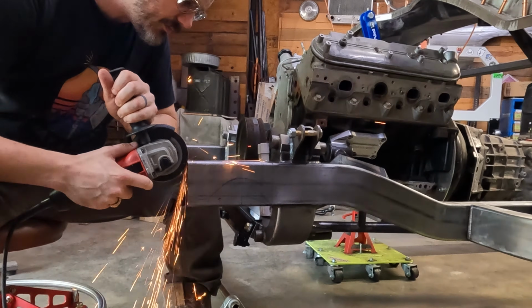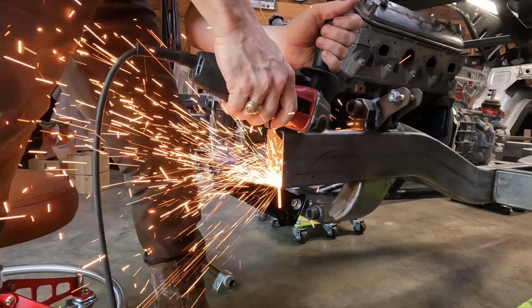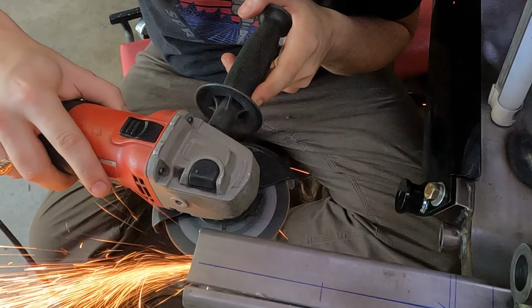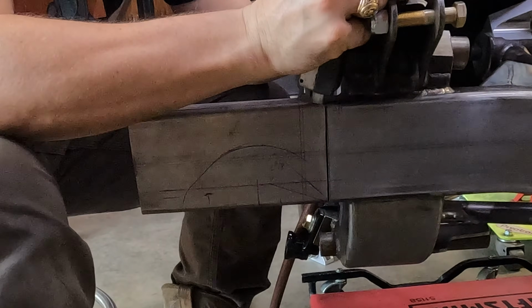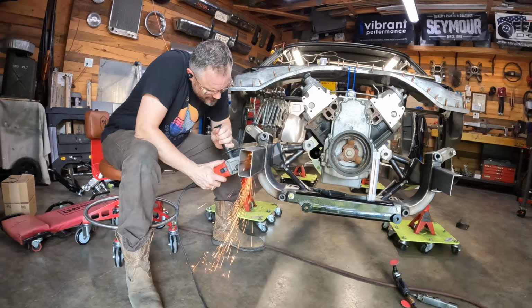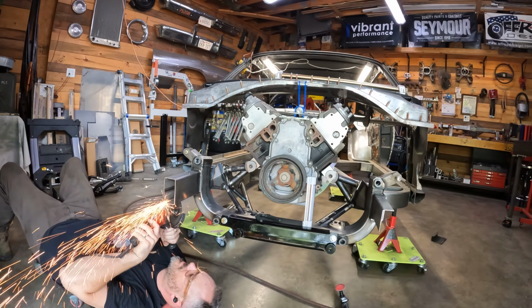Yeah. As you might guess, the plan didn't work. Structural tube has a load of stresses in it, and as soon as you cut it longitudinally, it's going to curl up like a potato chip. Now, truthfully, I made several mistakes, but at the root, it's a fool's errand trying to make a structural shape that is already an off-the-shelf piece. Like, don't make a 3x2, go get one and cut it to length. That's my lesson.